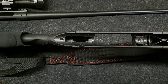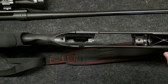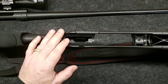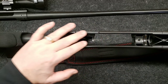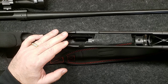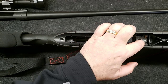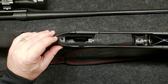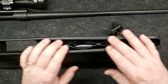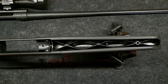These pillars aren't coming up very far. After a lot of thought, I think what I want to do is JB weld all of this in here and bed the receiver into this plastic stock. To do that, we'll have to scuff this up — I think I'm going to use a little drill bit and drill some holes to give the JB weld something to stick to. The second thing we want to do is on the front of this, we need to stiffen it up and fill these chambers with something.